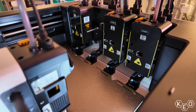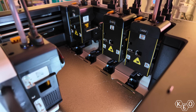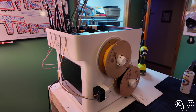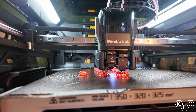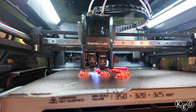In the case of the Snapmaker, now we've got a lot of wasted space because we need room for all of these idle tool heads. Additionally, we've just multiplied the complexity and cost of the system, because now there's four different filament tubes, feeder motors, data cables, and of course the tool heads themselves. The other end of the spectrum is a multi-nozzle tool head, but as we've seen with the H2D, this comes at its own cost as well — print speed. If the tool head has more complexity on board, not only do you have some of the same disadvantages, but now the thing is heavy and it can be difficult to fling around the printer fast and accurately.